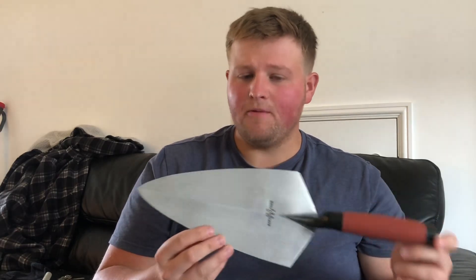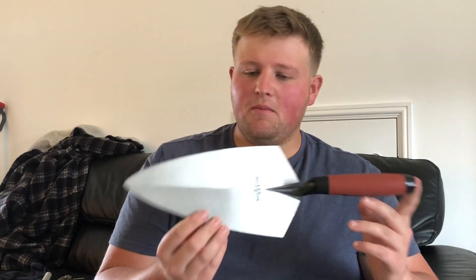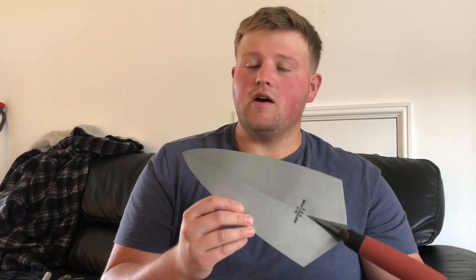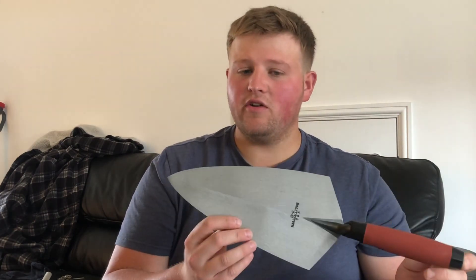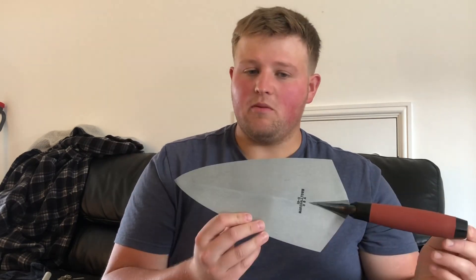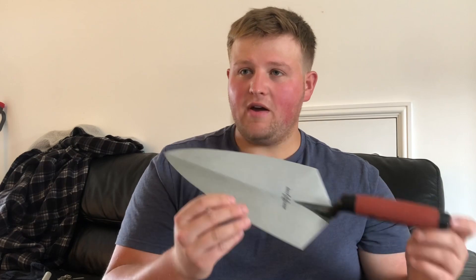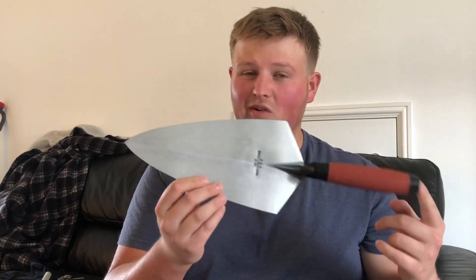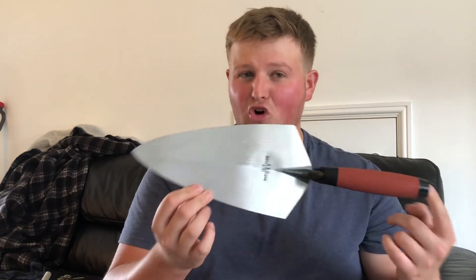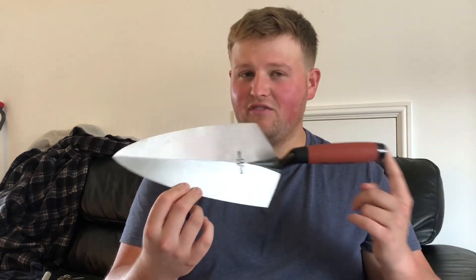In my recent videos reviewing the Magnuson level, I've been using more six-foot levels, more corners, and more freehand style laying. I'm going to be incorporating more profiles into that freehand style. I've got a new tool coming very soon that really lends itself well to building corners — that's the reason why I bought a bigger trowel. A lot of the time you can pick up two bricks' worth of mortar with one trowel load easily, and if you really scoop it up you can get about three bricks out of an 11-inch.